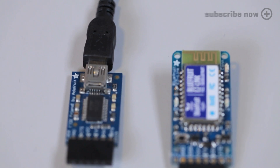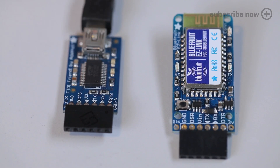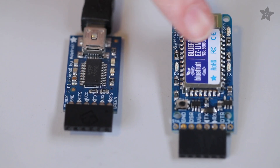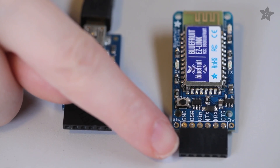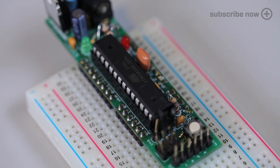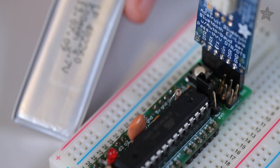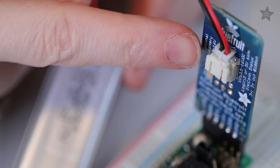The EasyLink module is a wireless Bluetooth drop-in replacement for an FTDI cable or FTDI friend. It's got a connection LED and two RX and TX LED indicators. There's a standard FTDI connector at the bottom as well. Solder on standard male headers and plug it directly into a breadboard, or solder in the female header so you can wirelessly reprogram your Arduino compatible. You can also connect an external battery to your project using the optional JST connector on the back.